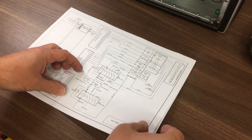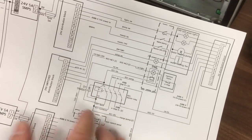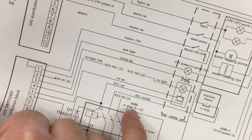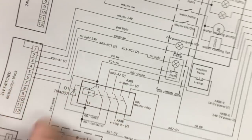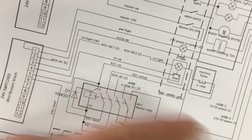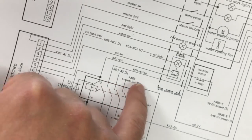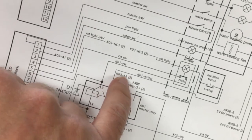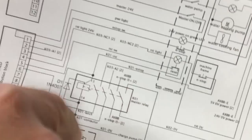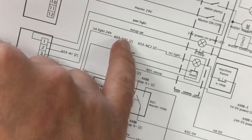And then on the second sheet, you'll notice, I believe the way you're supposed to do this is, you see that goes to AXBB E-stop I5, that's the input terminal 5, but because it's not on this sheet, I'll just put it in brackets. I have seen some people put a slash there, it tells you it's on page 2, but it's only for me, at least I know what that 2 means. And you'll see that contactor, that's A2, that will be the ground part of the relay coil. That's also on page 2, and so on. Some more are on page 2.